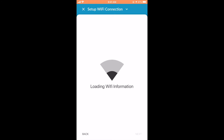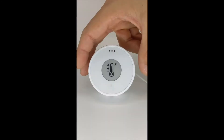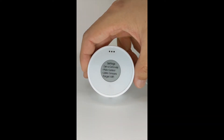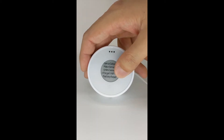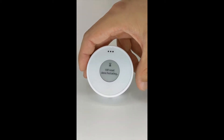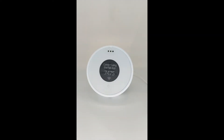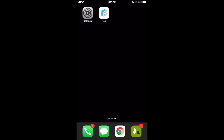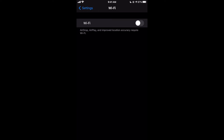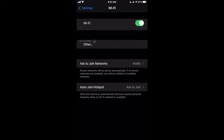If you've found that you're still having issues, go to the puck's gear menu and select Forget Wi-Fi to reset Wi-Fi credentials. Next, go to your Wi-Fi settings and stop and then start Wi-Fi service to clear out connections. Then restart the Wi-Fi setup process.